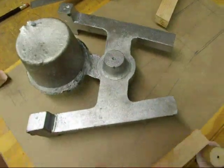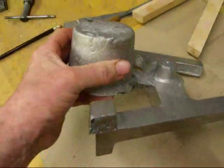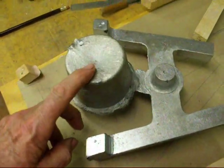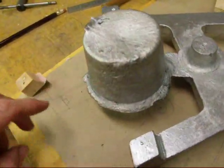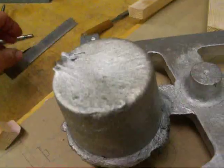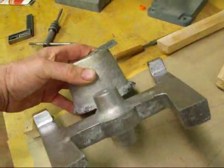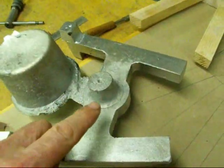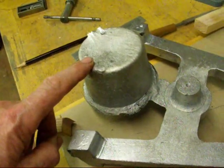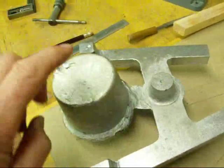Here's the casting for this pattern. This big cylinder of metal I'm holding is the riser — it is in a way a sacrificial piece, because notice that it is shrunk right in the middle. We've got quite a shrink hole there. To avoid shrinkage in the thickest part of the casting, I used a riser. This might be bigger than what I needed, but that will be sawed off and can be remelted later on.